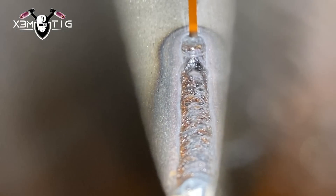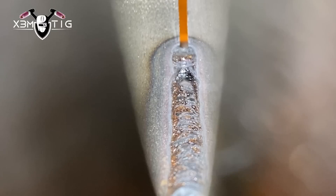I've seen some of you guys email me and send me your work to see what you're doing wrong, and this is one of the things I really noticed — lots of stops. Try to practice having fewer stops, especially on smaller diameter pipes. On a six inch pipe you should have only two stops, or only on tacks. Whatever tack you have to stop at, of course — but try to practice that. That's how you're gonna get a nice consistent root.